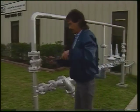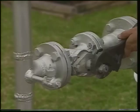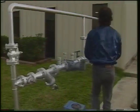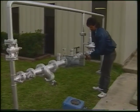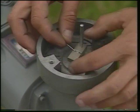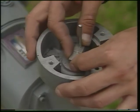The meter must not be rotating. To stop the meter, first open the bypass valve. Close the block valves to stop meter rotation. A drive dog is used to transmit movement from the instrument drive to the instrumentation. To attach the drive dog, position it on the shaft and insert the shear pin.